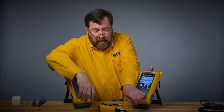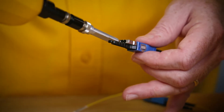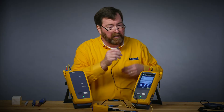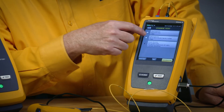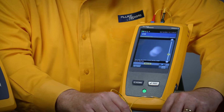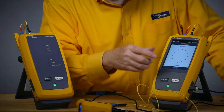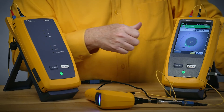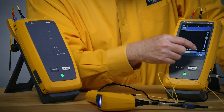There are two holes because there are two fibers. Remember to turn the camera on, and also the camera will work better if it's plugged in — you'll forget this, but then you'll realize. I'm going to change from my loss test to a fiber inspection test, use selected, push test to start. At first we're going to see it showing up as just a tiny dot — that's okay, because this camera is expecting to see a row of 12 fibers. So we'll say analyze, and instead of getting that low-resolution image, we'll get a high-resolution image showing the whole connector end face. Beautiful. Then we'll switch over and test the other connector, because there are two, to make sure both are in good shape.